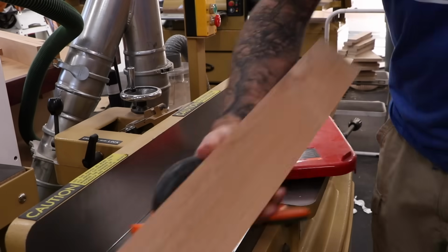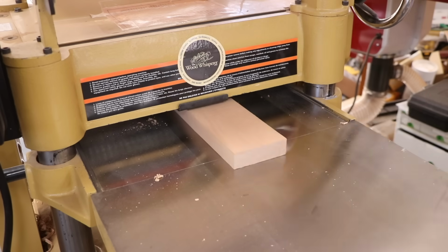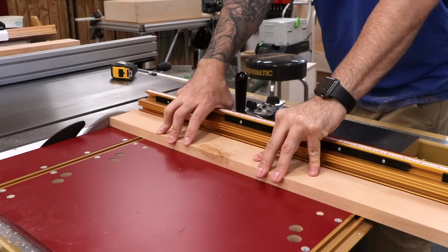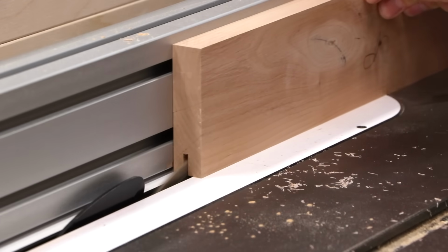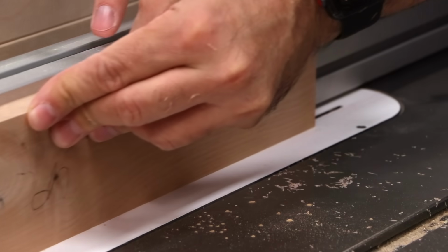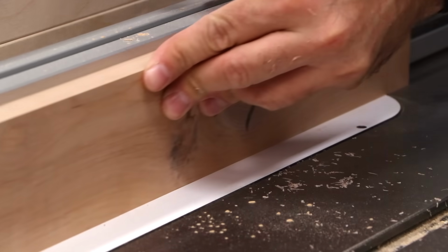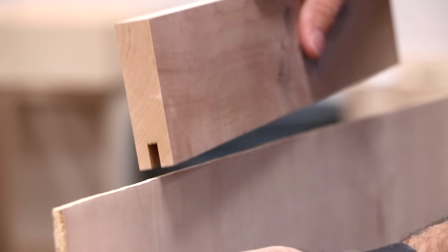face value. The rails and stiles are then milled to size. The panels will be 1/4-inch plywood, so I'll cut a groove in all the pieces at the table saw. 2 passes, flipping the workpiece in between, will result in a perfectly centered groove of the exact width.